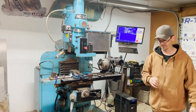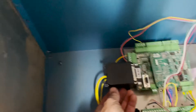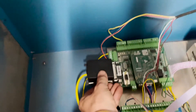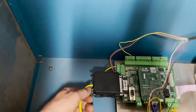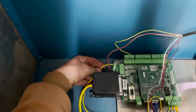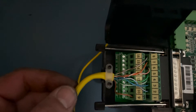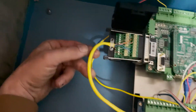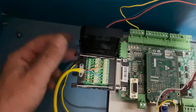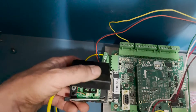Welcome to the spaghetti factory — we are serving wiring. I'm using the parallel port because my motor drivers are set up for five volt logic. I'm using pinouts two through nine to send step and direction signals to each of the motor drivers. I just hacked off the ends of a Cat6 networking cable and stuffed it in there, wired those up — step, direction — in order as per the diagram. I got that on Amazon fairly inexpensively and I'll put a link in the description.